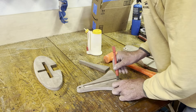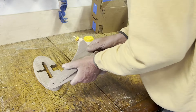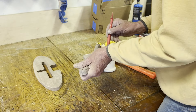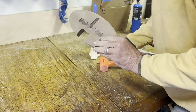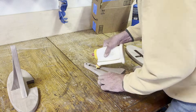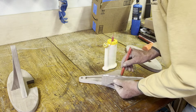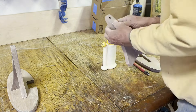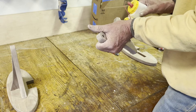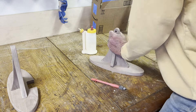As I do the assembly I'll talk about the order of cutting, which is also in the Shaper Hub project. First, cut the little side brace that has no mortise — it's just an outline. Then cut the mortise in the side support for that brace. Finally, cut the mortise in the bottom — that oval shaped thing with the mortise. Doing things in that order lets you use the previously cut parts to test the mortise size and add negative offsets to get a snug but not overly tight fit for easier glue-up.